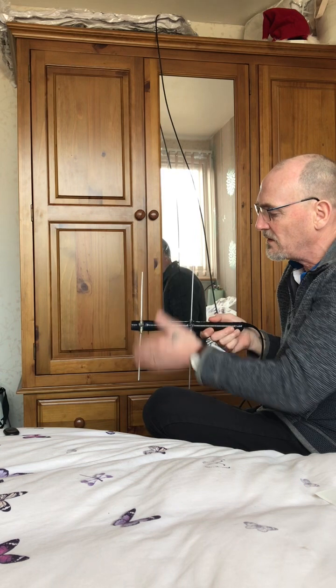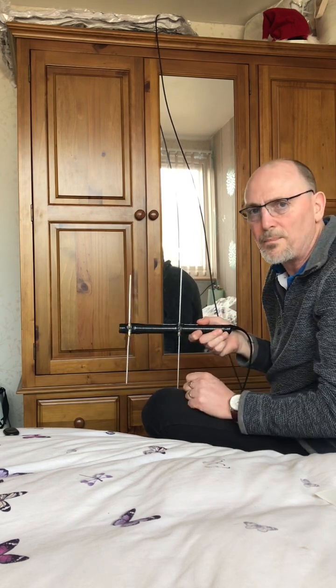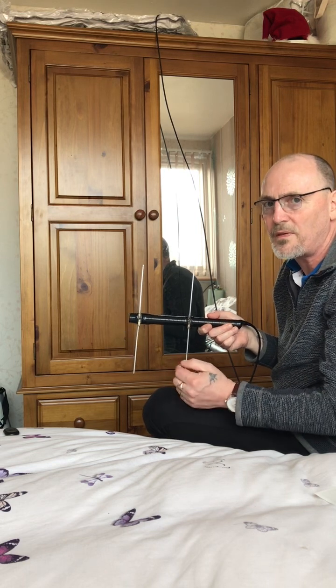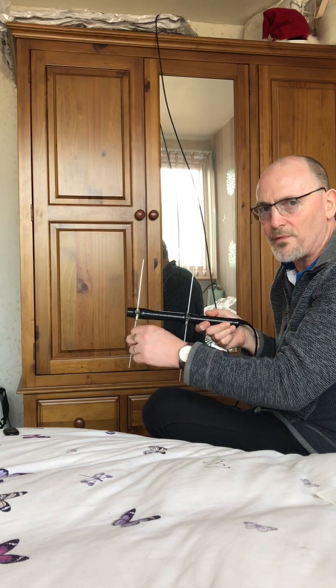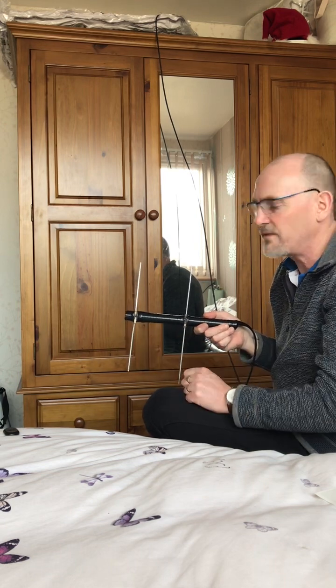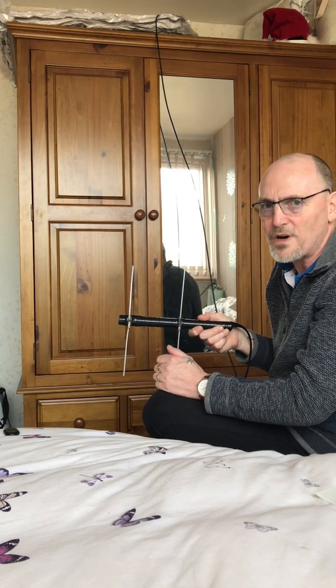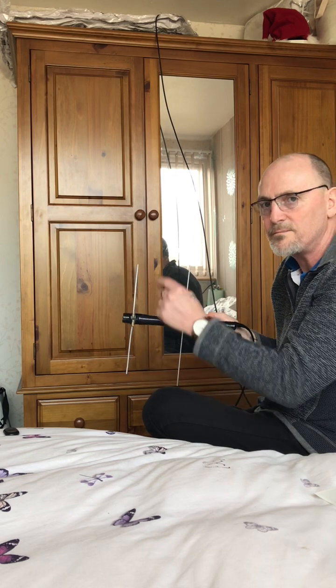Now the vertical stance of a Yagi suits people at home on FM who use white stick antennas. You'll have seen them up on their roofs. They've got a white stick up in the air, and it's got 3-4 radials off the bottom of it. That's a vertical, and most FM traffic on the higher bands is vertically polarised.